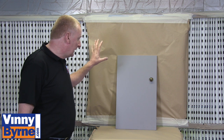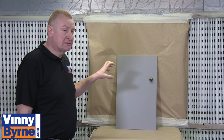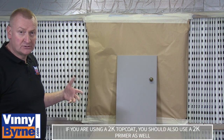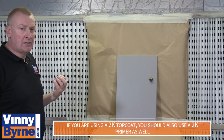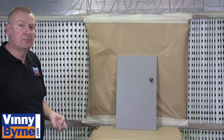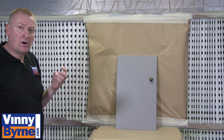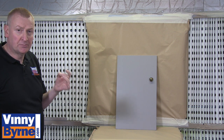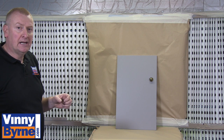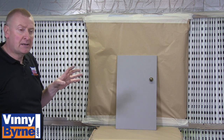We've finished now. We applied a double coat of the finishing PU paint. It's dry and it's a 10% sheen — a nice, tough, durable finish, and it was easy to use. A lot of people use a one-component primer and put a 2K PU over the top, but that's not really the recommended thing to do. It does work, but all manufacturers will always recommend that if you're using a two-component paint, use a two-component primer underneath it.